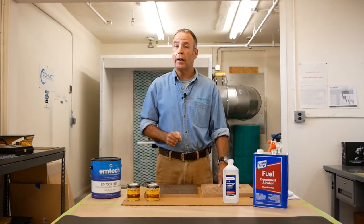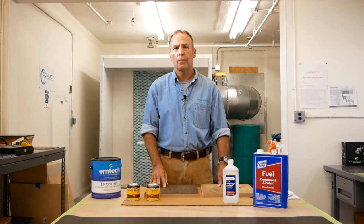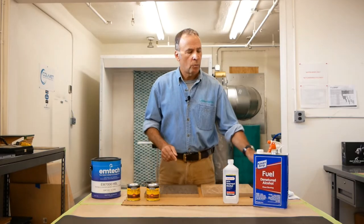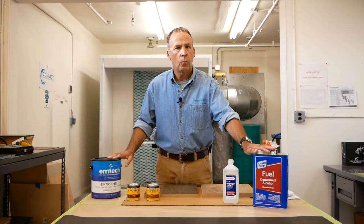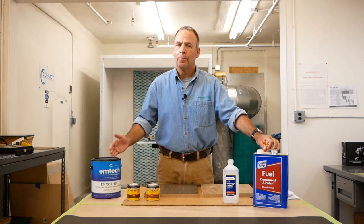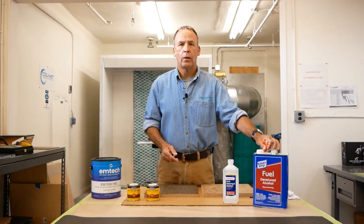Two, what is left behind is usually a long evaporating solvent, mineral spirits, Rule 66 solvents, something along those lines. So you need to remove that before you move to putting your water-based clear coat on top. Now, how do we do that? The easiest way to do it is to take either isopropyl alcohol or denatured alcohol, whatever is available in your area, and reduce it with water 1:1. Half, 50-50. You do the math as long as the alcohol of choice is reduced with water.